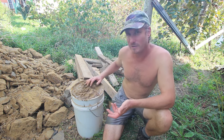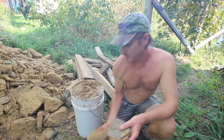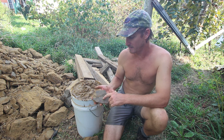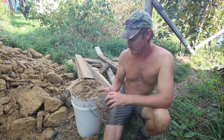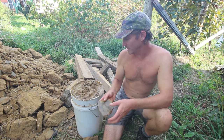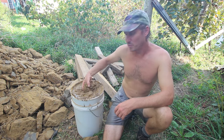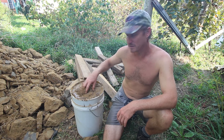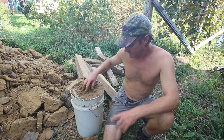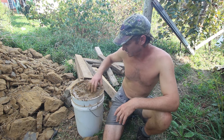The reason I wanted to test it was because there are different kinds of plaster in here. There's the subfloor, and then there's the surface — these finished layers that have a linseed oil coating on them. I wanted to see if, when I soak this, they end up not really dissolving and breaking down enough. But just looking at the stuff, although this is a little bit wet, pretty much all of it's breaking down. That linseed oil layer is soft enough that it seems like it's not going to be a problem.